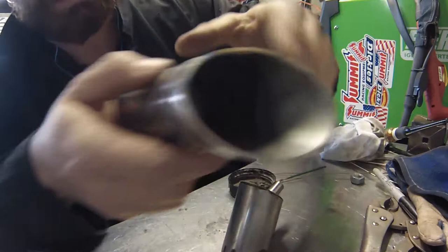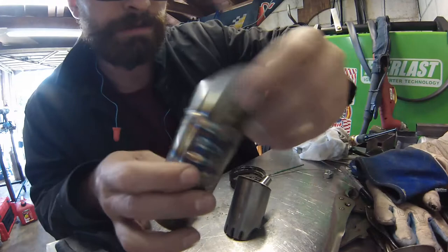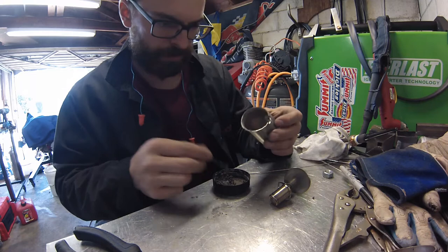I'm doing that on the inside — that's oxides getting into the stainless. This is just practice; I wasn't trying to prevent that. But that way you don't have to purge it. Just coat the pieces that are going to get welded with this goop.